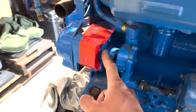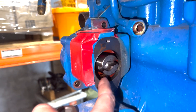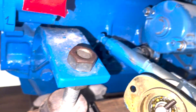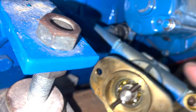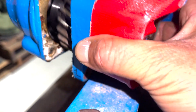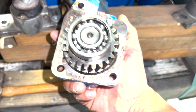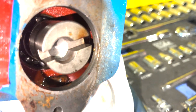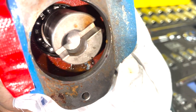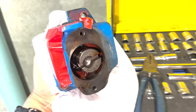I'm just taking off this housing for the mechanical pump. That's the cam for the mechanical fuel pump. This is the water pump — there's grease in there, which is good. So the whole reason to take this thing off is that inside there there's a whole bunch of fragments from when the pump self-destructed.